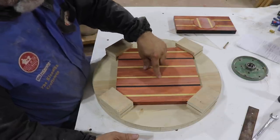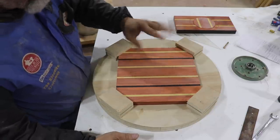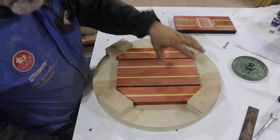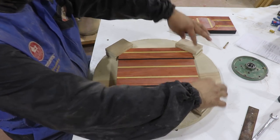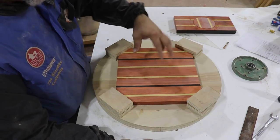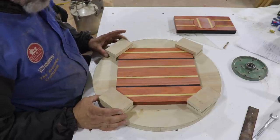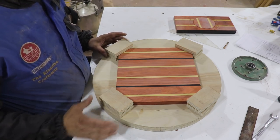And then I'm going to cut my first circle with a parting tool. Then I'll cut my second one, third one, fourth one, however many I'm going to cut. And because of the angle, that piece that I cut won't be able to get out, and it'll be safely nestled in there. If it turns out that it's not safe, these are going to be bolted. So I can take the bolts out of these two, for example, slide the whole piece out, take the rings I've already cut out of the piece, put it back in and keep cutting some more. So I'm going to finish putting this thing together, and I'm going to bring it back when it's on the lathe, and we'll see how it works out.